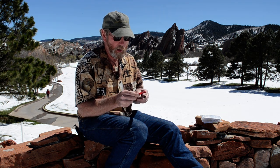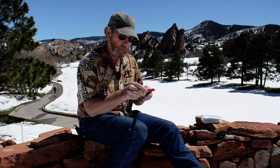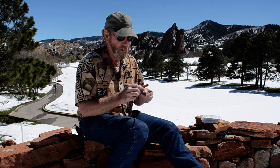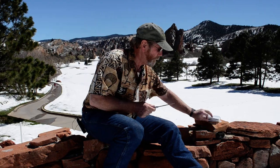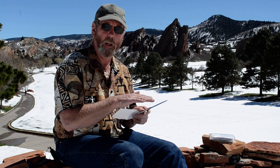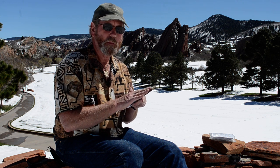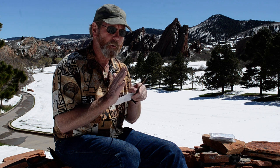Now I'm going to touch the knife even lighter, flipping the knife every pass. Why am I doing this and touching it so light? I'm going to polish that blade just a little bit — polish the cutting edge — back and forth, back and forth, back and forth, to take that little tiny micro burr, that wire edge, that burr, whatever you want to call it, off the blade as best I can. If I can cut pieces off the blade, that'll take it down; if I can get lighter with my touch and take less of a piece off, that's starting to smooth the blade. If I use the open face to polish the blade, of course I can sharpen a knife from dull to sharp.